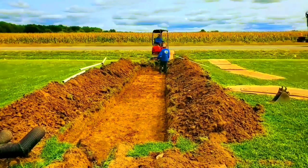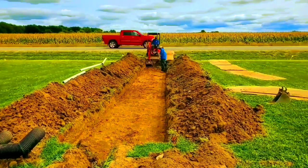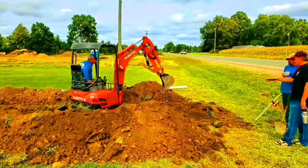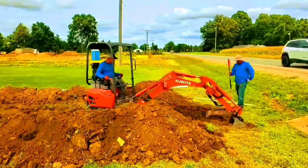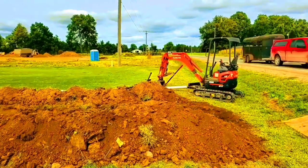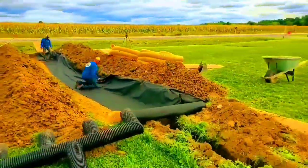These giant manifolds connect to knife-cut Baughman tile — virgin yellow knife-cut pipe, which I call a mini culvert pipe because of how incredibly strong it is. We use eight-ounce fabric in all our leach fields; you want to use eight-ounce fabric because it's going to last forever. Go ahead and burrito-wrap your whole leach field system. You'll see us put straw on some of ours because we don't want them to freeze in the north. This particular one was a really unique situation — there were some specific things we had to do so that this gentleman's yard no longer held water.